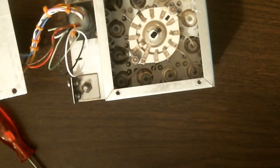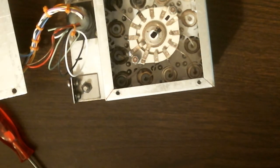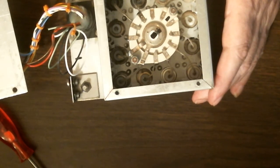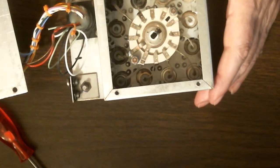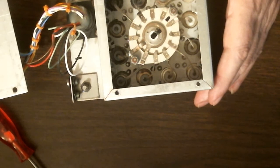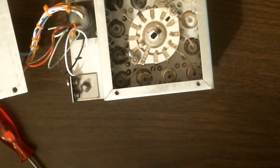The switch itself has two wafers mounted one on top of the other — you cannot see the second one. To access it, I'd have to take the whole box apart, which is very difficult because there are a lot of small 4-40 screws with nuts — four per connector, times twelve connectors. There are two wafers, and they are powerful enough; one would do. The power I was running was from a homebrew 8877 amplifier that I built.